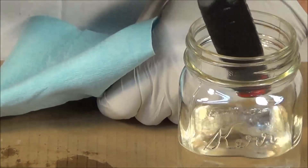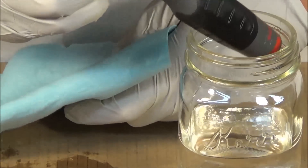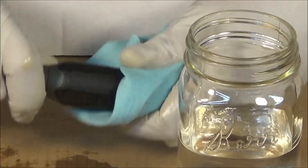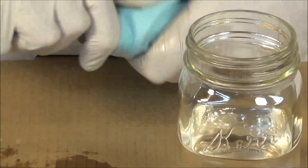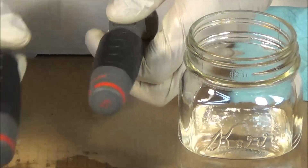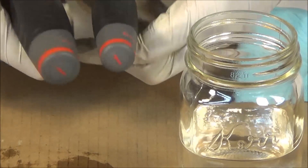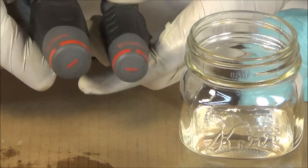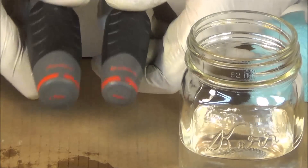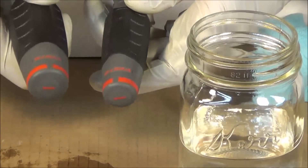Now we're going to try the brake cleaner. This is extremely corrosive when it comes to tools in general because it will just eat the paint or rubber off of things immediately — typically brake cleaner will ruin pretty much any tool that's not metal. We'll go ahead and clean this off and compare it to our control. The good thing about brake cleaner is it dries pretty quickly, so the handle's already dry. There is no color change whatsoever, no swelling, and the handle's still very firm — it feels identical to the control. The brake cleaner had zero effect on the handle.